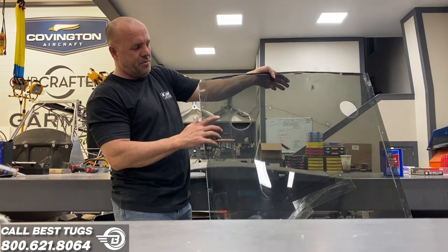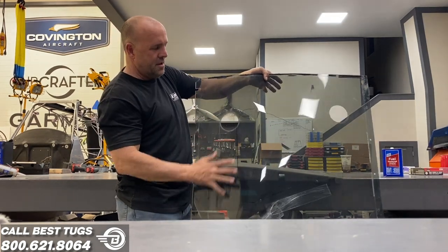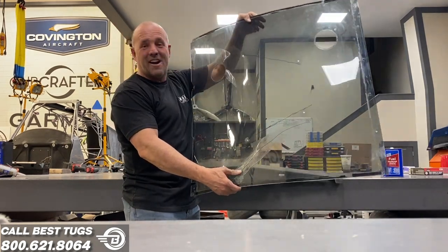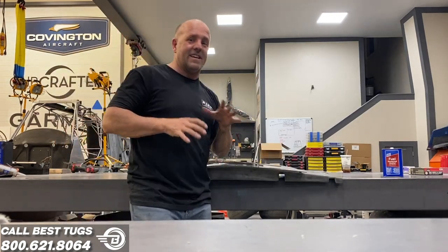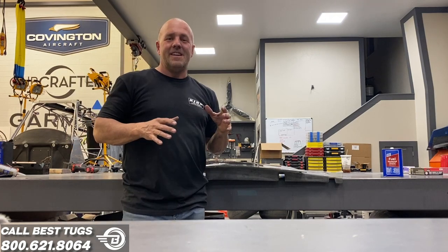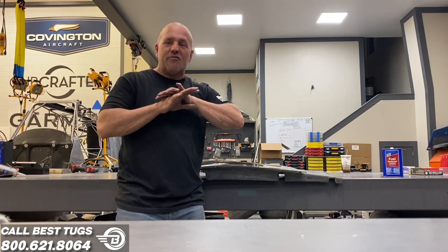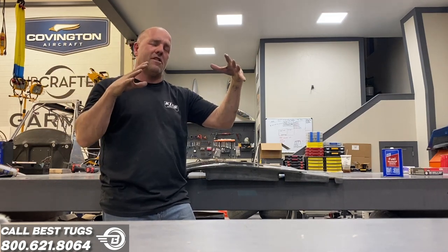Made a couple little wrinkles I was worried about when you're trying to heat up near a circle or an edge. But the area in the middle that I needed turned out great. I was a little worried about it. Now, there's a trick when you're heating up acrylic like this and getting it to move, and that's patience. That's the trick, patience. And really you need to keep the heat really even. So I started out with one light on it, wasn't enough. I ended up adding another pair of lights to it, two sets of 500 watt lights to get some heat on it.